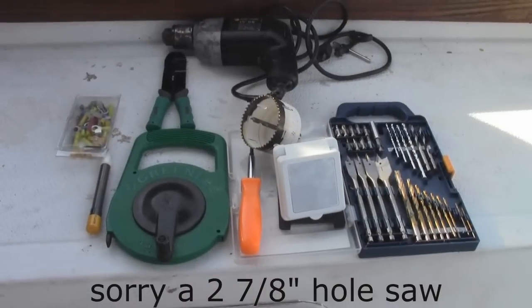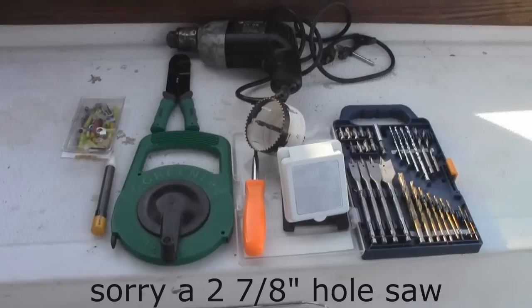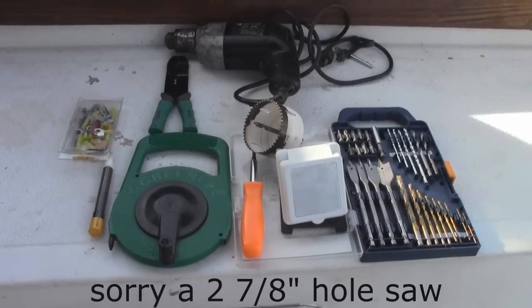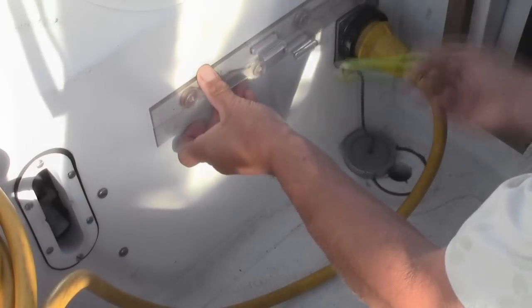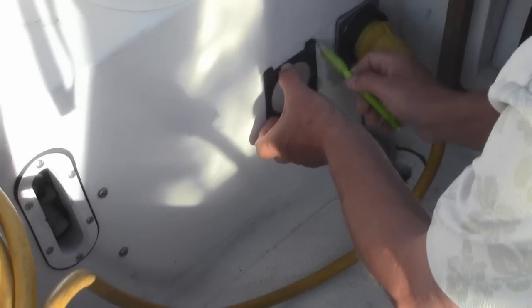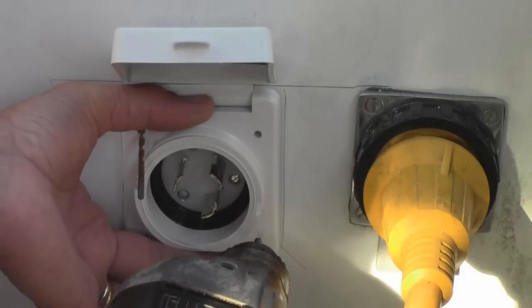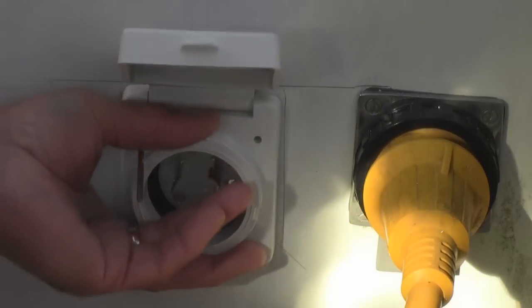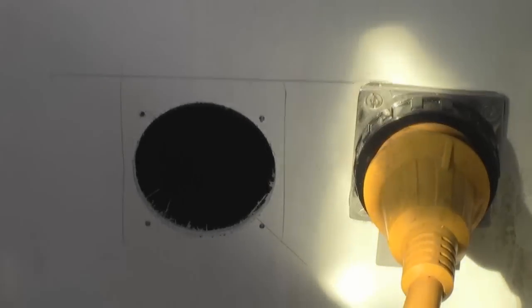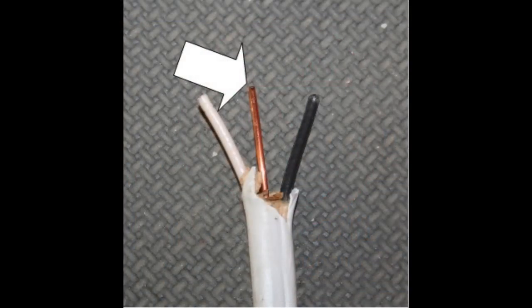For the installation, we're going to need a two-and-a-half-inch hole saw. To bolt it to the boat, you can use a threaded screw — pre-drill it and screw those in. The first step is to mark where the inlet adapter is going to go, mark that off, drill the hole, and pre-drill the holes for mounting the inlet.